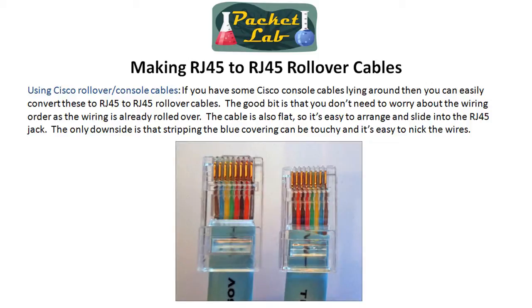The example I went through was really based on having a spool of ethernet cabling, but the same thing applies if you go out and buy a 100-foot ethernet cable — which I would recommend. I would probably lop off both ends and start with the cabling as-is. You can save yourself an RJ45 connector by using one of the existing ones — just lop off, say, four feet behind that and then roll over based on the pinout of the already-existing ethernet cable. For me though, the cost of a couple RJ45 jacks isn't that great, so I'll just lop off the ends and use whatever color coding I wish.